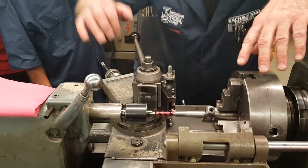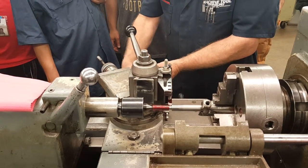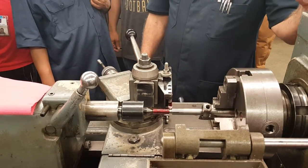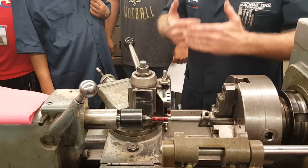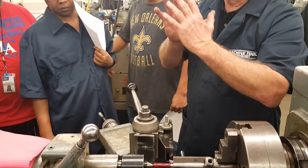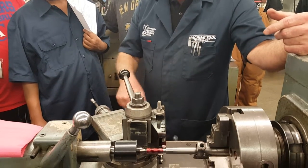So I'm happy with that. What I'm going to do is back this away one revolution all the way around, pass zero and come back into zero. Why am I doing that? So you're getting rid of the slop - slopping the lead screws. Remember, any of these lead screws, when I reverse direction, you have wear on the acme threads so that you're not actually moving for a short period of time. So you want to go way beyond that. It's easiest to remember the zeros.